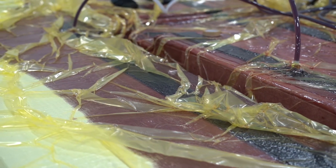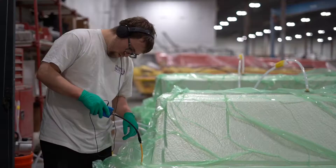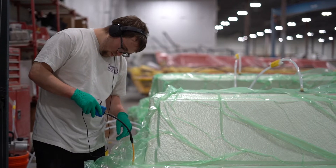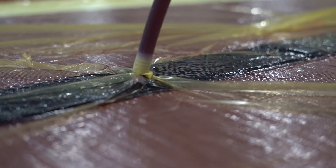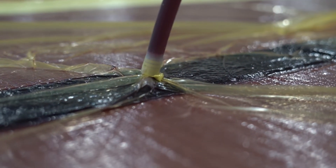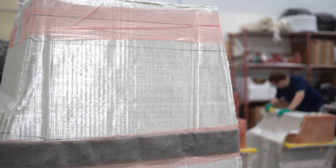Because of the infusion method, our lamination process is cleaner and allows for the hull building to take place outside of the spray booth. Infusion produces more consistent construction from part to part, a consistently uniform glass to resin ratio, and far less wasted resin than in an open molded construction method. Additionally, the infusion process leads to cleaner working conditions and is more environmentally friendly.